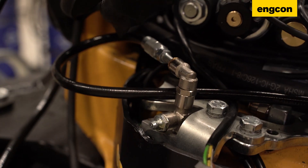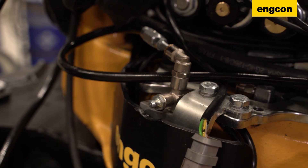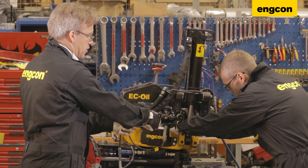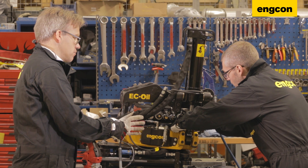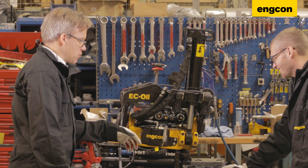It's like a quick connector. That way you can disconnect all the greasers, and once it starts greasing and works, you take away one, start greasing — if it works, then you'll see that that greaser might be the problem.